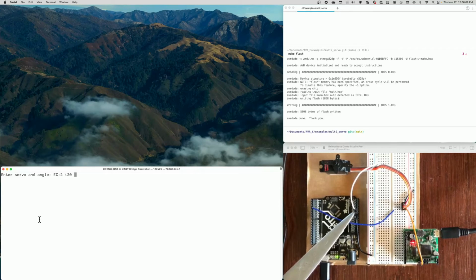So that will provide an analog signal, which we can convert to digital and will help us understand where the servo is positioned. And then we have the brown and red wires, which are power and ground to the servo. And that's being driven from the small power supply that's also on the Labrador. And then I'm looking at the control signal via the oscilloscope channel right here. And so we'll be able to see that on the Labrador when I bring it up. So that's the electronics part of it.